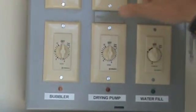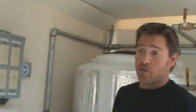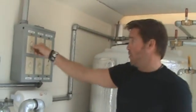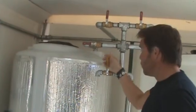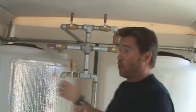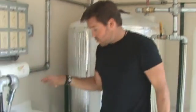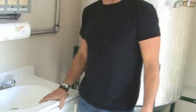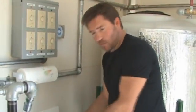The same applies to the main pump, pumping station, or water wash — depending on the size of your batch, there'll be different time settings you can set on this control panel. Literally, when you come in here to work a batch, you come in, set your times, move whatever valves need to be moved, and then you go away and let the process happen on its own. Also, one of the unique features of our mobile unit is that the larger unit comes with a sink built in so you can do your cleanup after making your biodiesel.